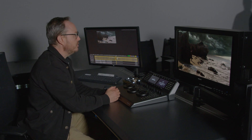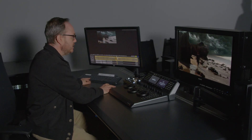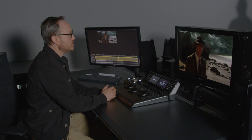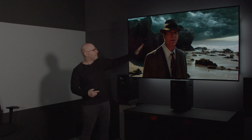Let's hit play on the sequence and see what we're seeing between the two monitors. I just want to get a little bit further, see somebody close up and get an idea of skin tone, perhaps. I'm noticing a lot more red in his skin tone here as compared to what I'm seeing on this monitor. As a calibrator, I'm going to ask Josh: are you seeing a red tone to the entire image, or is it more focused just on his skin tone? I think in this image I'm seeing it mostly in just his skin tone.